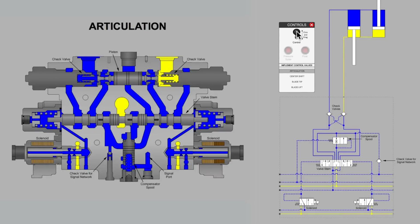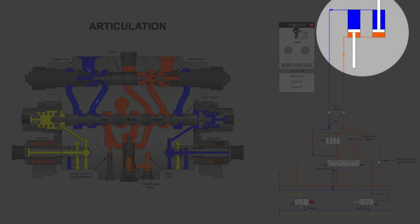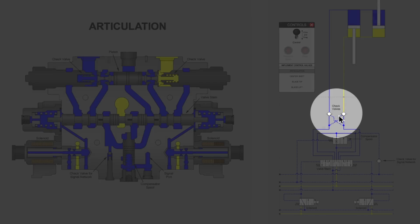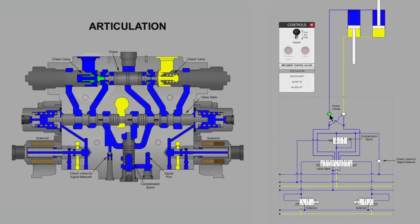Welcome back for our third and last part where we look at cylinders that refuse to stay in place when we need them to, using pilot-operated check valves to keep the cylinders locked in position. There was no evidence of any external leakage around the cylinders, their hoses, and fittings going back to the valve bank, which means that the valve bank itself becomes quite suspect.